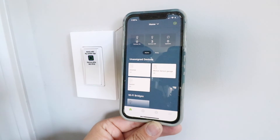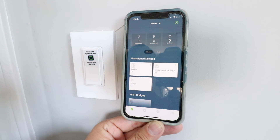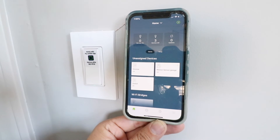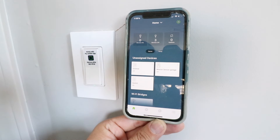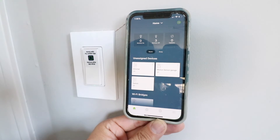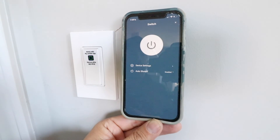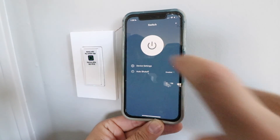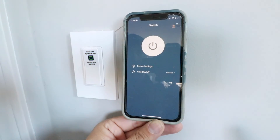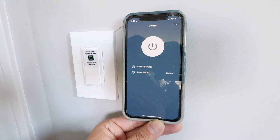Here's our smart light switch that we installed, and now if I click right here I can turn it on and off right from the app. That is how you install a smart light switch. This particular switch does require a neutral wire for installation but it has been very reliable in my testing. There are also smart dimmers you can install, and there's a wide variety of smart light switches available. We've got videos on all different types so check those out in the description below. In the app settings you can change the name, turn it on and off from your phone, and change the auto shut-off so it turns off automatically after a certain period of time.